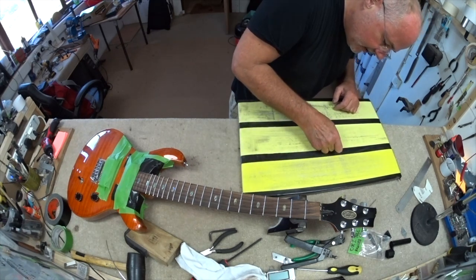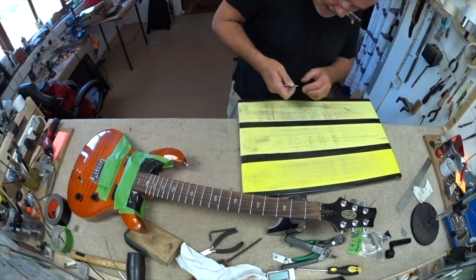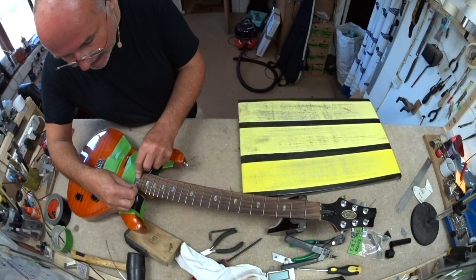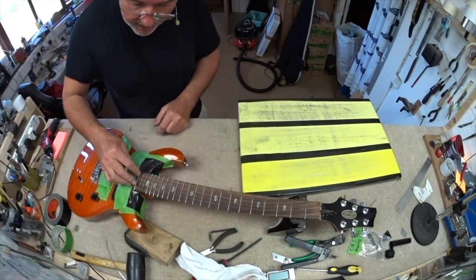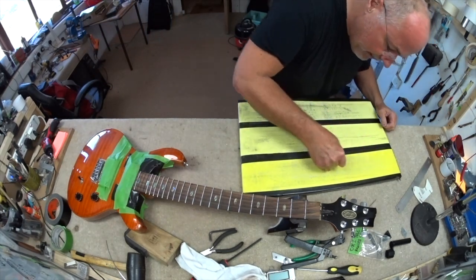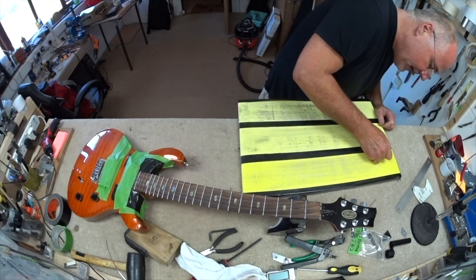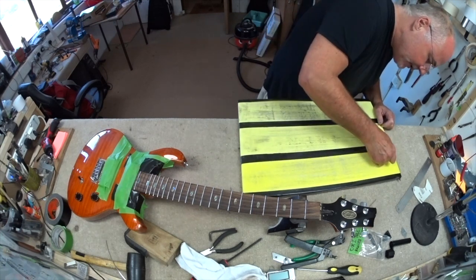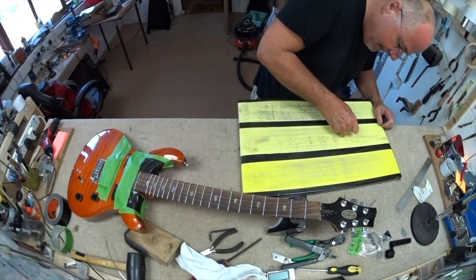So you can see this is not a quick business, but it does work, and it's the only way of protecting the end piece, the finish. That sits in perfectly well. I'm happy with that. So I'm just getting the bevel up on one side first, assessing the amount of overhang at the other end, and then making a combined bevel stroke trim at the other end to complete the operation.